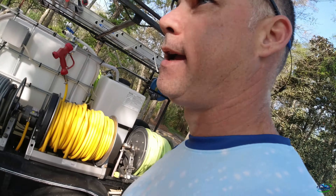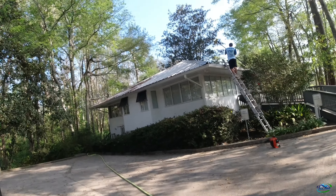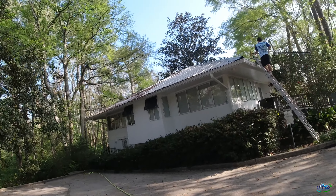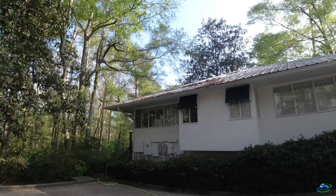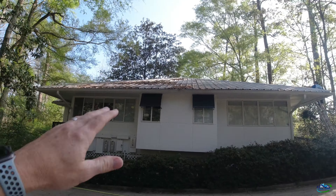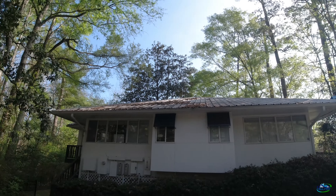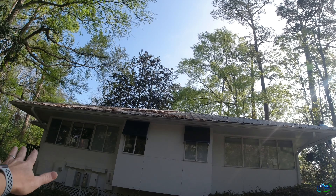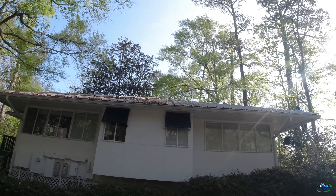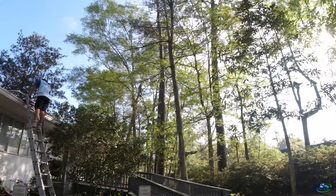All Pro Exterior Services here again with another annual roof job. This is a commercial building and it's a Saturday — we had to wait until Saturday because kids are in and out. We're going to remove the debris and hit it with about a 2% solution, same as last time and it came out nice. They added gutter guards so we're not cleaning the gutters, and the building isn't dirty so we're not spraying the building — just using the AR.